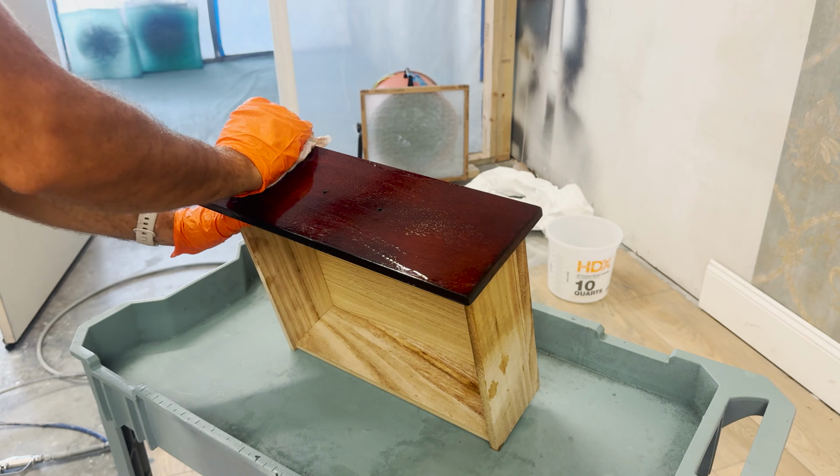So this is Centurion's vinyl sealer, and this is before I knew what kind of top coat I was going to use. I was still thinking I was probably going to use lacquer, but this is okay under the 2K urethane that I'm going to use, but I don't know that it'd be the recommended primer. You should probably use just a regular automotive high build primer if you're going to do this, and use car paint. But I just decided to use that because that's what I had available, and I really wasn't thinking about using car paint at this point.